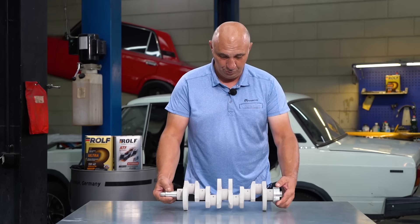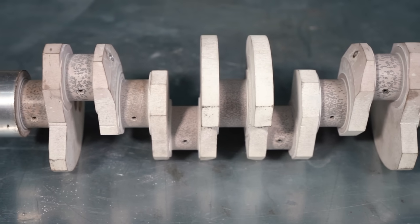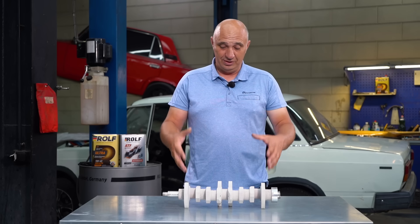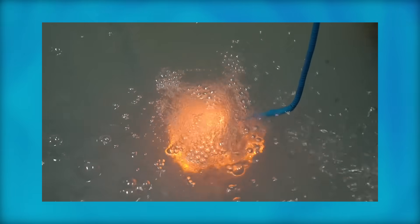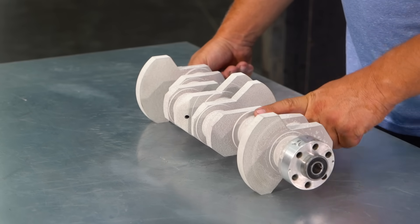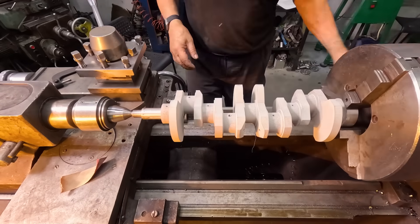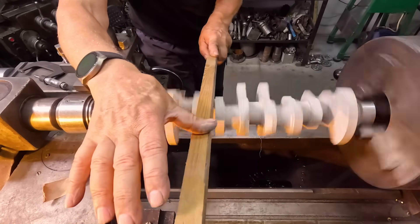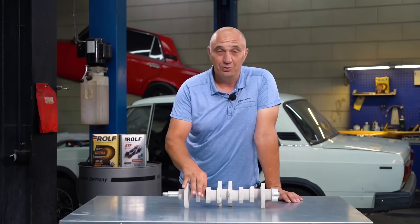And here's what they've come up with. They have applied a really hard ceramic coating. They immerse parts into an enormous tub with a solvent. There's some plating and high voltage involved. The high voltage results in one material fusing with the other — one sort of even embeds itself into the other. And now we can be sure that the bearings will be able to work with no issues. Now the finish is a bit on the rough side, meaning that we still need to do a bit of machining. So let's get to work on that.